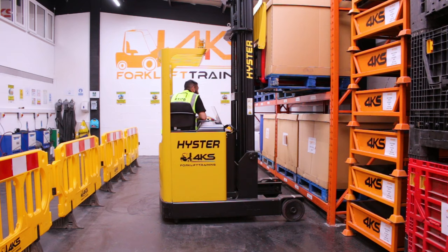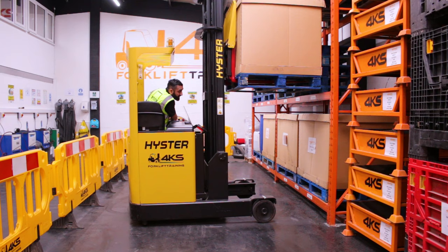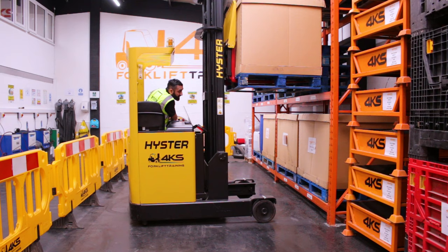Apply your foot brake, have a look at both sides of the pallet — everything in order. Carry on reversing and looking in the direction of travel. Have a stop and check if your pallet has come out of the racking. If not, just gently creep in reverse and stop once the pallet is six inches away from the racking. Apply your handbrake back into neutral.